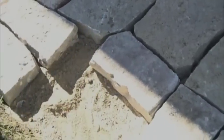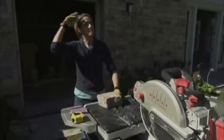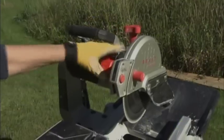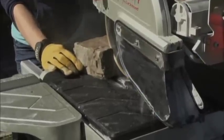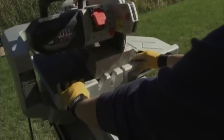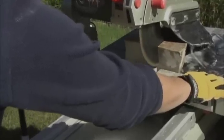That being said, we are not afraid to fire up the beast when we need to make some cuts. Now you might think that's a name Wes or Bucky came up with, but actually that is our wet saw — the kind of thing you'd use for cutting large format stone or ceramic tile, with a 10-inch blade and 15-amp motor. That means it's pretty well set up for cutting paver-sized stone as well. It'll do plunge cuts, which is great for inside corners, and we have an extension on the table for cutting tile up to 24 inches square.